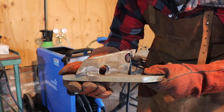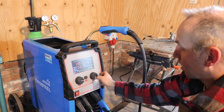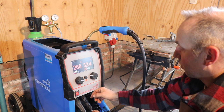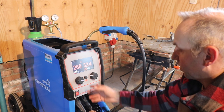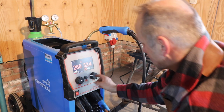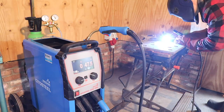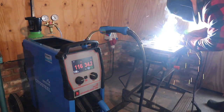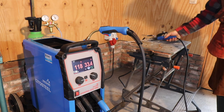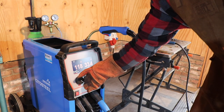This is exactly why I bought this high-power machine - to melt this type of structure. Now let's also do a part with MMA welding. Starting at 110 amps - but this is somewhat thicker material, so let's put it a little bit higher. It doesn't look good at all, so let's make a second run. I'll go back to the settings according to the manufacturer.